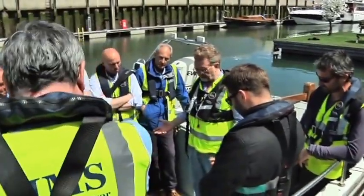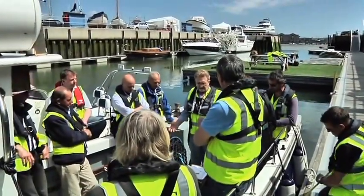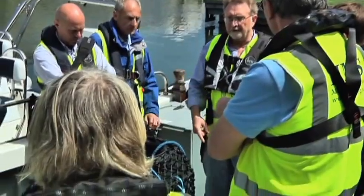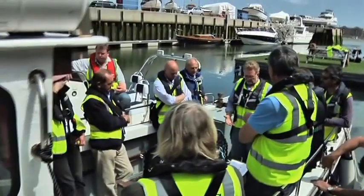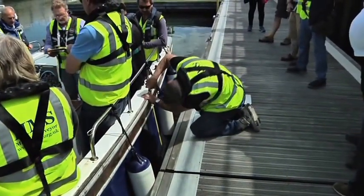Upright freeboards would be just what we've got: gear and equipment in its usual position, people arranged so the boat's generally upright. Depending on what the boat is, that could be people down the sides. If it's got seating down the middle, for example, it could be people all sitting on the middle seating on the centreline. It's just the people on board that are going to be there, so the boat's, broadly speaking, upright. So, John and Keith, would you like to measure the loaded upright freeboards?